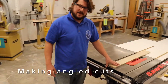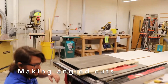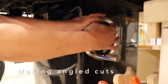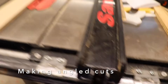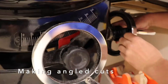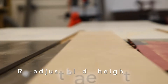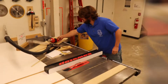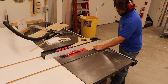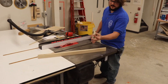On this piece of material I'd like to demonstrate an angled cut — we're going to cut it at 35 degrees, useful for making a cleat or any angled cut. I loosen the lock and crank the wheel, watching the dial until I reach 35 degrees, then lock that angle in. Looking at the blade, you can see it's now a little bit lower than needed, so I crank it up just a hair to compensate for the height lost while leaning the blade over. Now the piece is cut with a 35 degree angle.